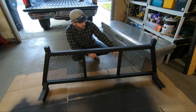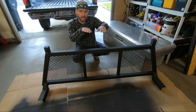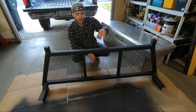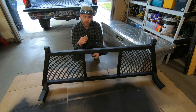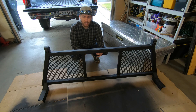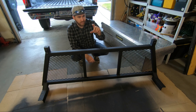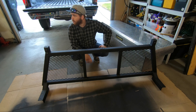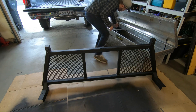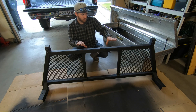I'm going to put the tool box back on — it's going to sit a little uneven, so to level that out I got some two inch flat bar that's quarter inch thick and made myself a couple of thick washers. I could have gone to the hardware store and stacked up washers, but I wanted it to look a bit more professional. I have seven-sixteenths bolts that are about two inches long that'll go down there, and I also got some rubber strips I'm going to put underneath to keep vibrations at a minimum and not make anything noisy.